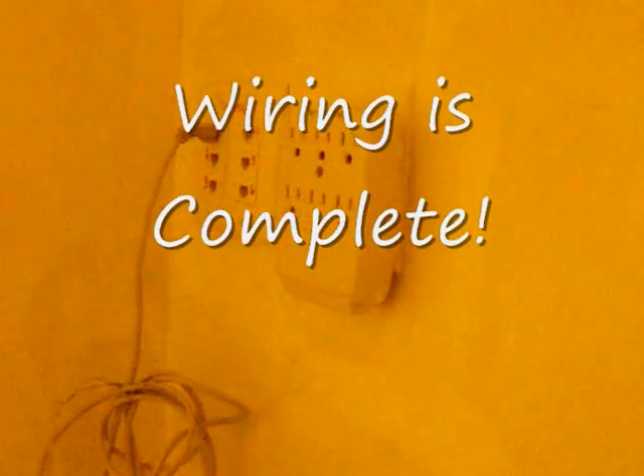Here is the finished wiring job. We already have one cable patched from the office up to the rest of the house, and eventually we're going to invert this setup so that the point of presence will be here in the closet and both the office and the house will be served from this same location. You can see our Belkin surge protectors installed in the individual gang outlets — we've got a total of a dozen devices here, with six circuits feeding the office and another six Ethernet circuits feeding the house. Here is the cable input and the telephone back-feed input for the cable modem phone service as well.